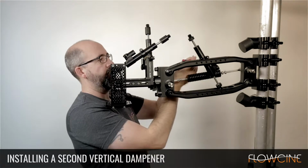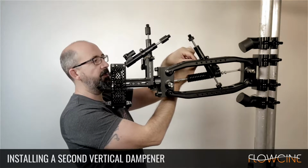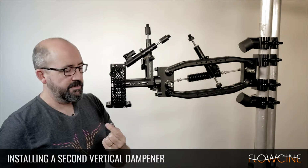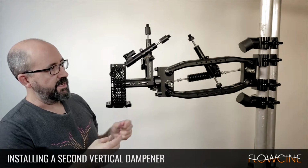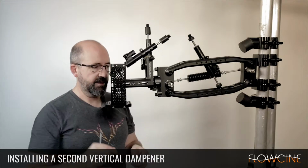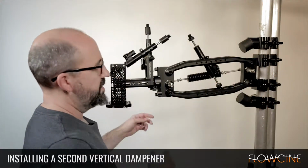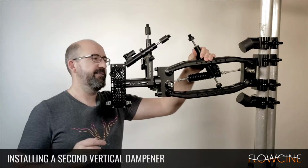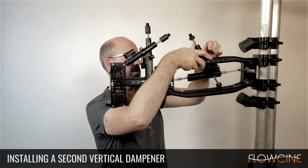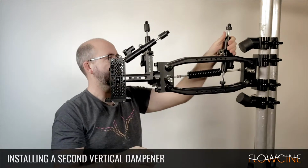Usually when you're out working with a black arm, always check that these screws are sitting tight, because a lot of vibrations go into the arm itself, and these small M4s can easily get undone. So always check that these are Loctited and sitting tight on the arm. So if I change the position of this one the very first time, it might sit very tight, as it should. It shouldn't have any play sideways. So yeah, this is really tight. So I'm gonna undo this.